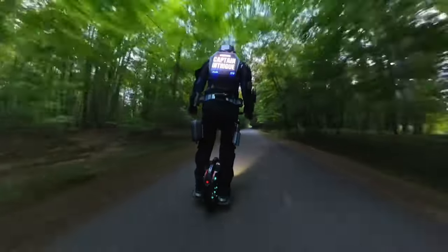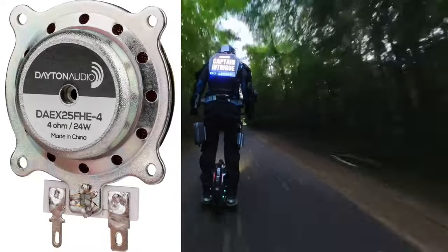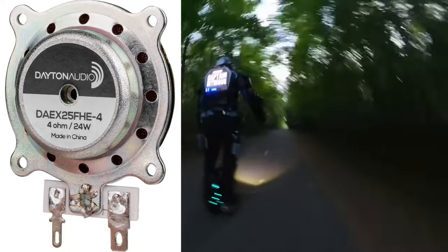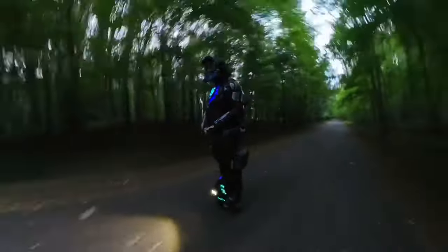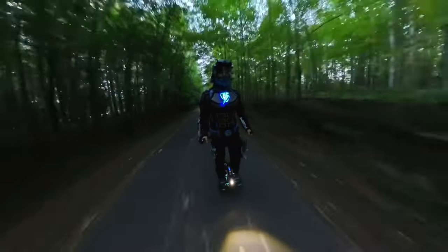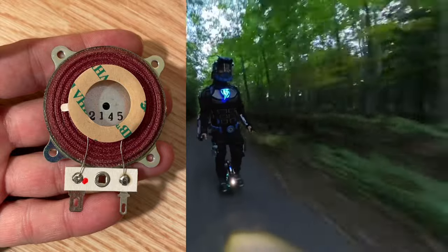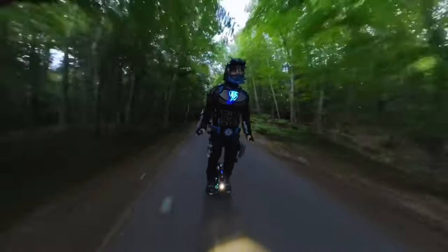I don't have room for a large, heavy speaker in my armor, so I used an exciter instead. An exciter is also an electromagnetic coil very similar to a regular speaker, but instead of being attached to a paper cone, it's attached to any hard surface you have available. It's attached using strong adhesive peel-and-stick tape, and the surface it attaches to then becomes the speaker.